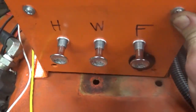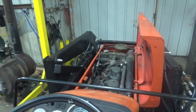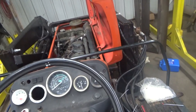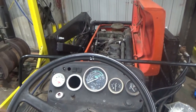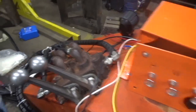So you can see this is simple circuitry. I mean, literally anyone who has a basic fundamental knowledge of working with their hands and understands crimp connections and the most basic wiring can do it. However, I will say if you rewire something like this, when in doubt, get a GM one-wire alternator, because this one still uses its original voltage regulator, which is hidden up in here to dictate when or not the alternator is charging. And that was not easy to install. That required some quality time with my good friend Mechanic Steve, but he was really cool and helped me get it wired up. And so let's do this and then try it out.